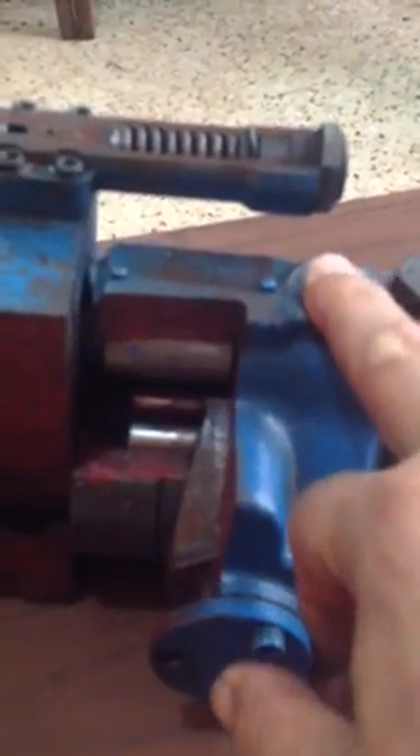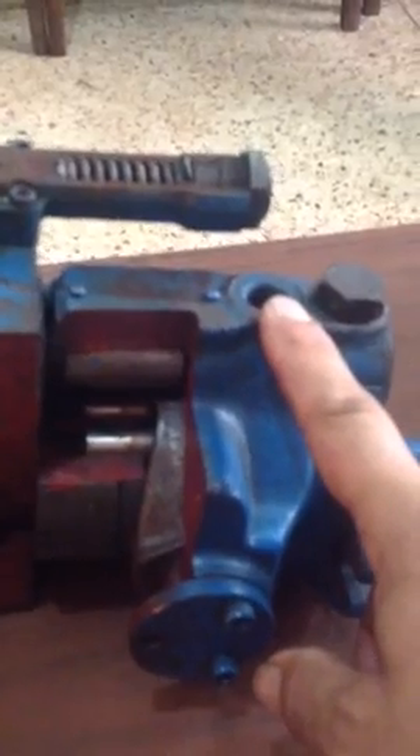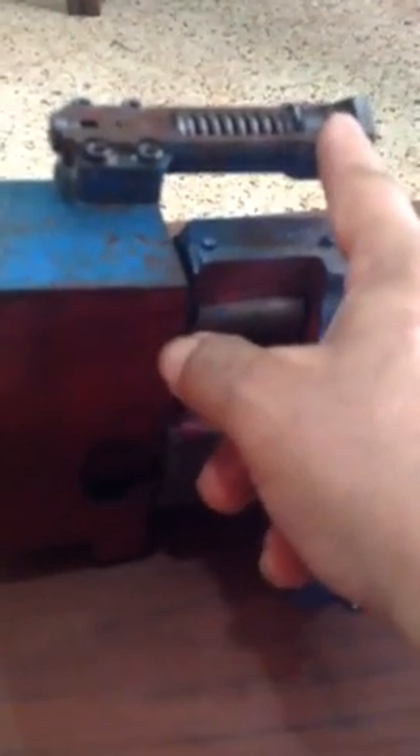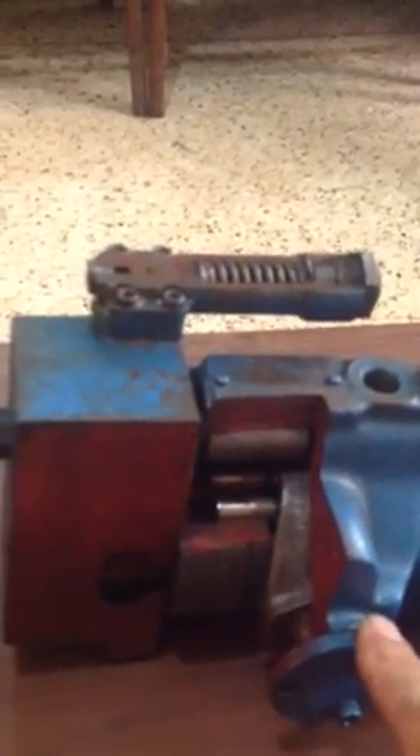This one is the drain line, which should always be attached to the tank and should be filled up during installation. When installing a new pump, you should fill the body with oil through this drain port so that all the internal components are lubricated. This pressure relief valve comes in different ranges from 0 to 5000 PSI.